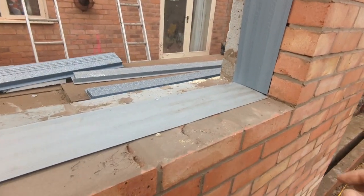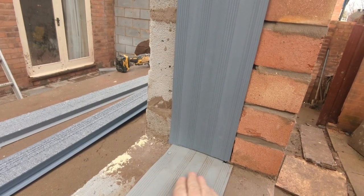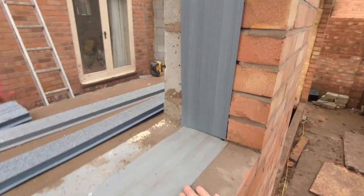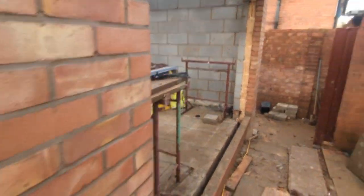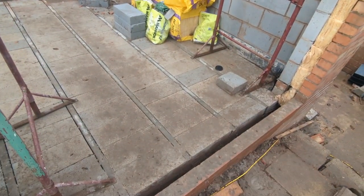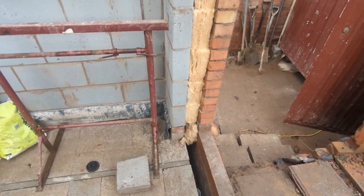And that's that, all done. The reason that goes in there - you get a nice sort of finish. You've made an effort to try and keep the thermal value all the way around wherever it is. No thermal breaks. Still got to be plasterboarded and everything. And that's how you do it. On the doors you don't do it at the bottom. Windows are sill only - you don't bother with the bottom of any doors or anything like that because the insulation's going across anyway to close that.